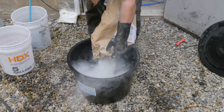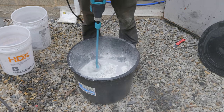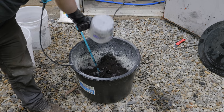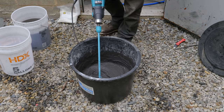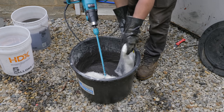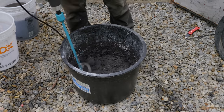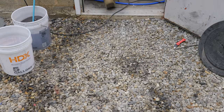Next it was time to get the first layer of backer coat mixed up, which was the same process as the face coat — adding the water, then the GFRC mix, then the pigment. I upgraded to a larger, wider mixing tub, and this made a huge difference versus mixing in a five-gallon bucket. After thoroughly mixing, I could add what really makes GFRC work: the glass fibers. These fibers act sort of the same way as rebar, increasing the concrete's tensile strength, but they're a lot easier for thinner projects like this since you don't have to worry about the rebar popping through your finished surface.